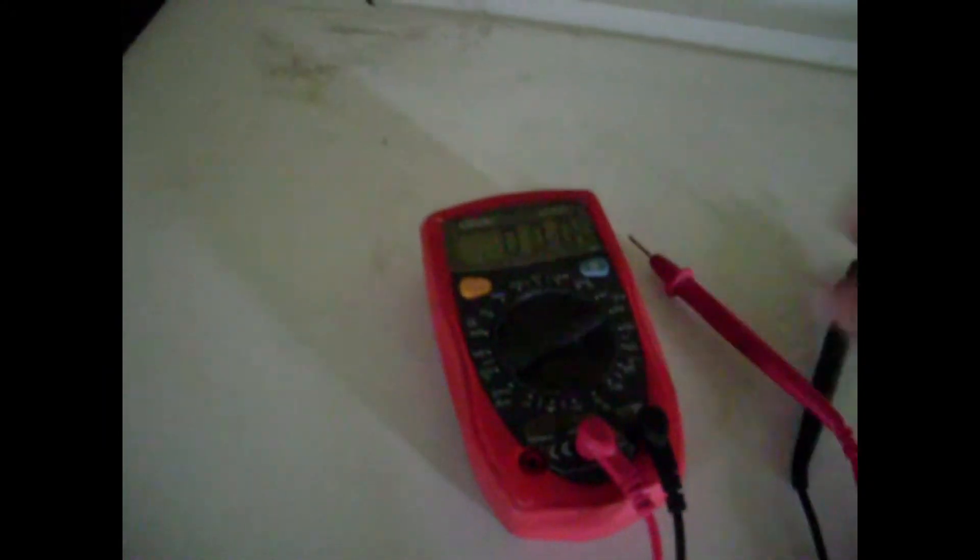At the moment I don't know what sort of power we're going to be getting out of it, we'll just do a quick check. We're getting 37 volts out of it — it's not very good, it's a bit cloudy outside, but it'll still be warming up the hot water. Basically what it does is run DC straight into the hot water system and it heats it up. It was boiling water the other day.